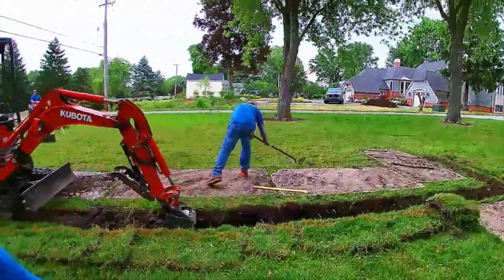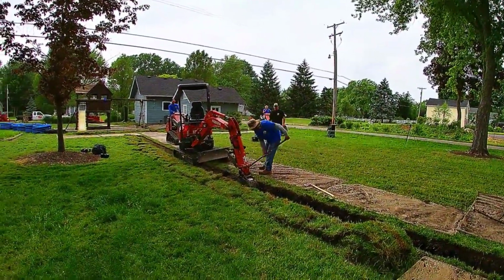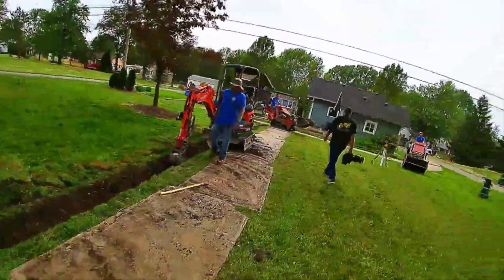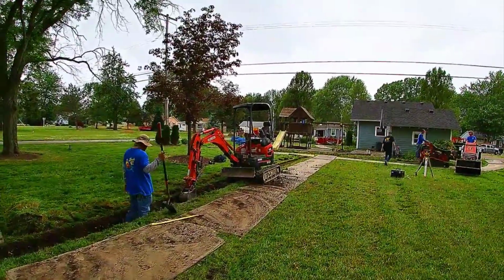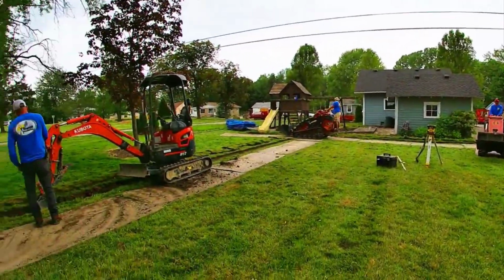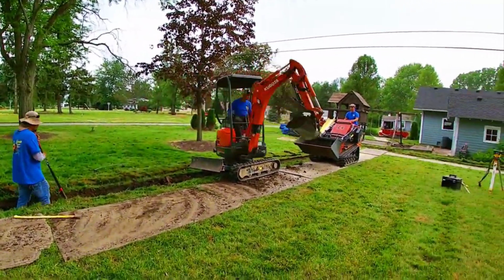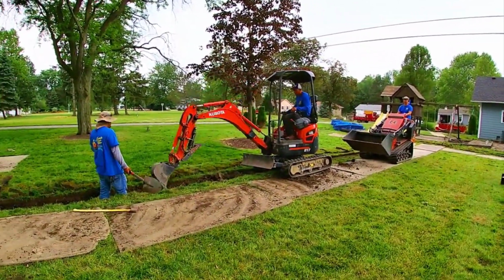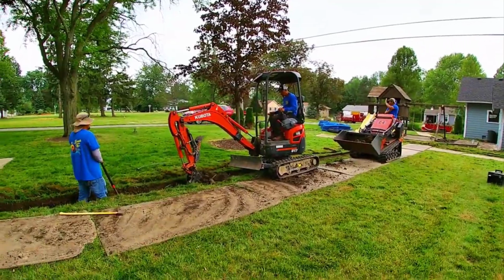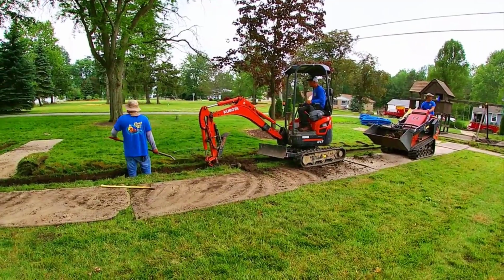It's going to pull water in faster. It's going to literally take in the water quicker. If water's being, say, removed slower, it allows your yard to become saturated. That's the problem with these Home Depot pipes and these pipes that people are buying at Lowe's. Even the agricultural 8 slot that people like to buy, the yellow. You're going to compromise your yard, because when the system removes the water, but it takes longer, it's just going to end up turning your yard into a spongy mess. Our systems move the water so quick, it evacuates the water immediately from the yard.